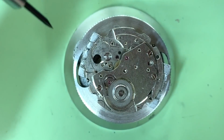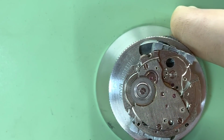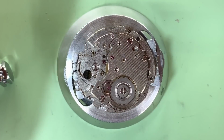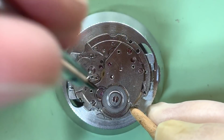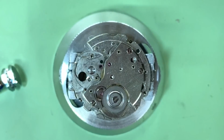And then with the ratchet, once you've got it, it'll then always want to wind the spring. You can't really see this now. Let's just try and change the angle. Maybe a different screwdriver. No, I can't show it to you. So you can hear that's whizzing away, but you want to just nip up the screw a little bit more. So I hold the ratchet wheel with my peg wood and just try and give it a half a turn. And that gives it enough.